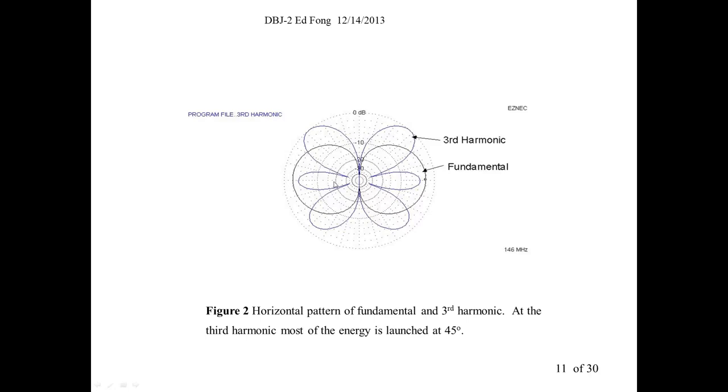Now you're typically standing here. This is sea level. Your partner's standing here, and he starts walking out. And here's the sky. So if you look from above, it has an elevation pattern. It's 360 degrees coverage, like a donut. Right? If you look from above, it's covering 360 degrees. And the great thing about a vertical dipole is you don't shoot the energy up into the sky. It's pretty confined to the Earth. A vertical dipole performs fairly well at the fundamental.